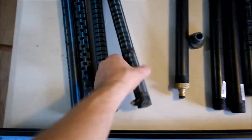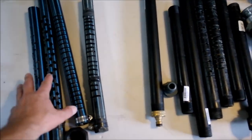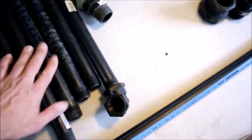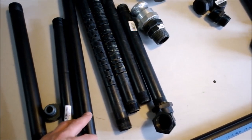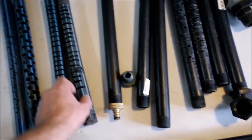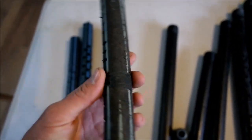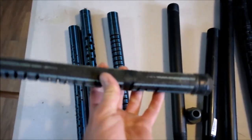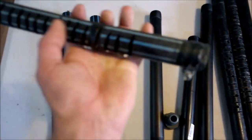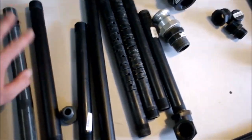The poly riser is a little thinner — it's 25mm, the poly pipe is 32mm. On the bigger high bankers it's better to get the larger spray and more water. But this poly pipe is really quite heavy duty and pretty resilient. The riser will crack easier — this poly pipe has lasted about 2 years being hammered in the snow in Ballarat, in the rain, out in the sun all day. One day I dropped the shovel a little too hard on it, it split, got some tape and kept it going for that day, then retired it. I like this stuff because it's cheap.